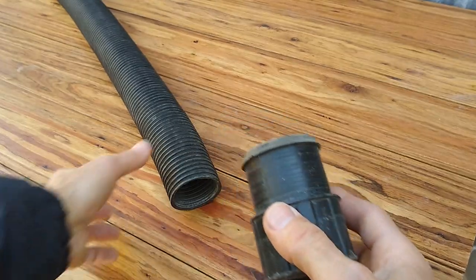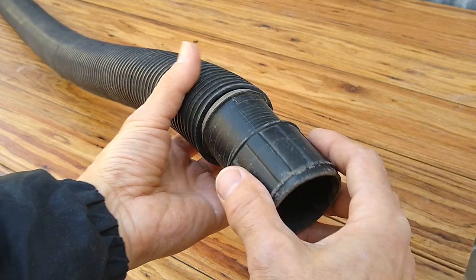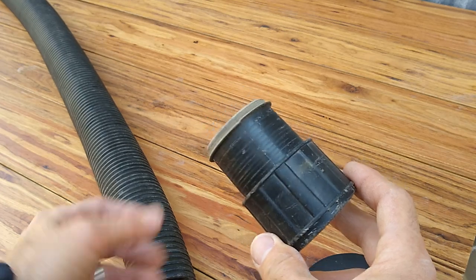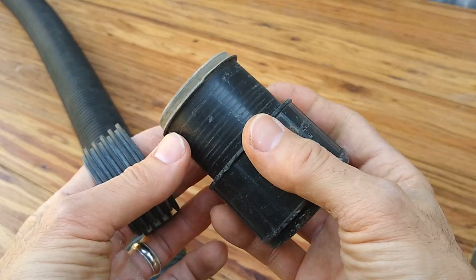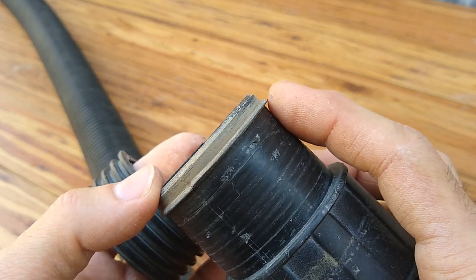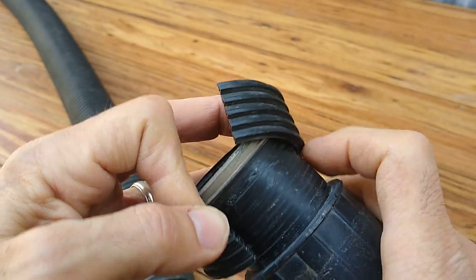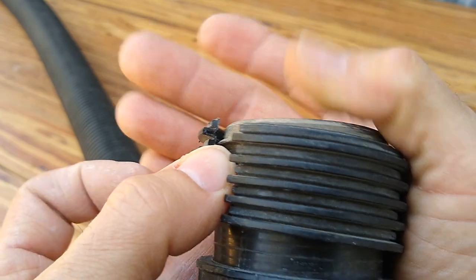If you've ever wondered how these hose ends go on — the hose end plugs into this part of the hose. You've got the standard raw tube and then you have this insert. I've always wondered how this thing can still rotate but there's no way to pull it out easily — I had to cut the hose to get it off. It has this ridge, this protrusion, and if you notice on one side it has an angle but on the other side it does not. The way it works is it grabs onto this part of the tube.